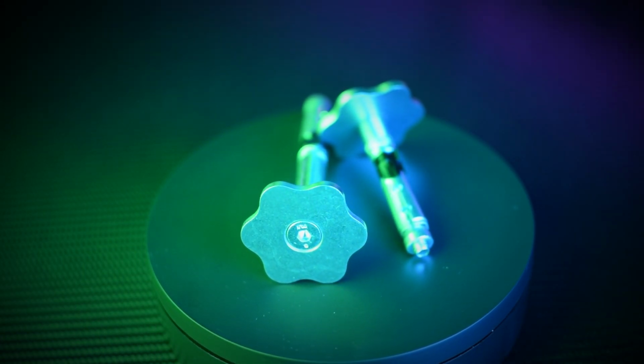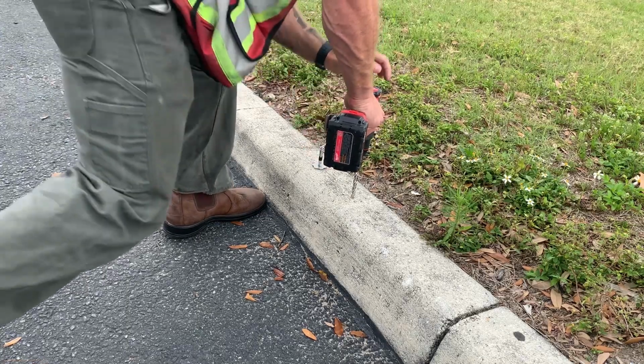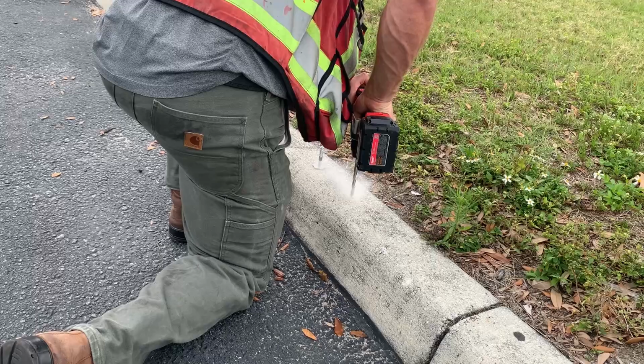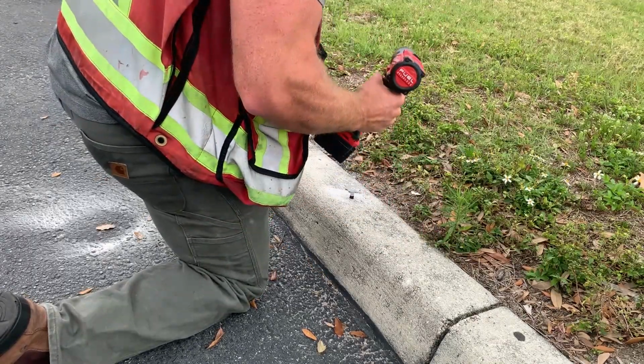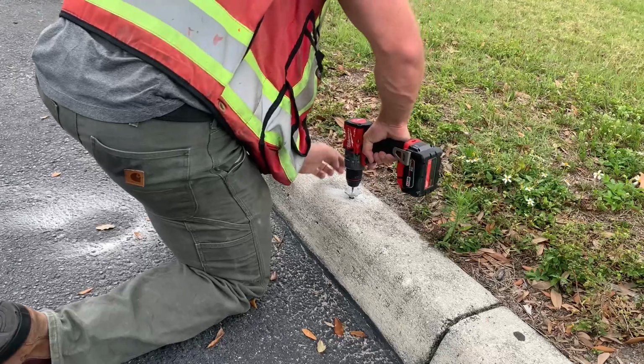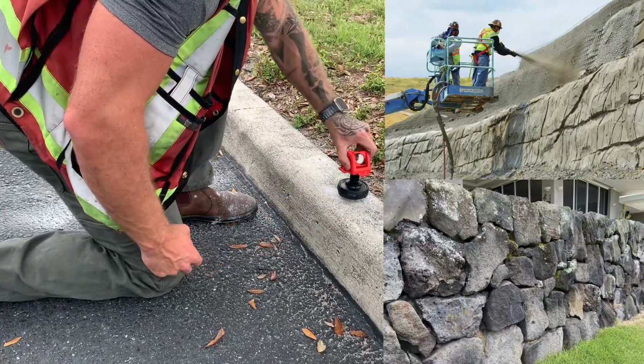This is basically an anchor bolt with a stainless disc attached to the top. Simply drill a 7/16 borehole, insert the anchor bolt, and tighten the Allen key head to expand the anchor bolt sleeve. I like to use this when mounting to an uneven surface like a shotcrete wall, or if there happens to be a conveniently placed boulder.